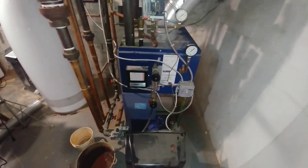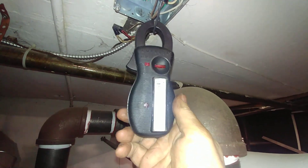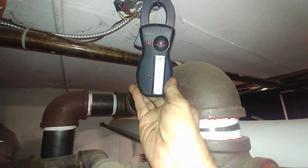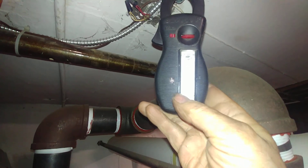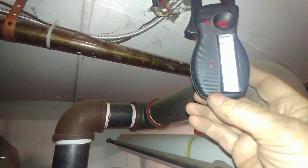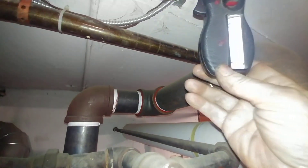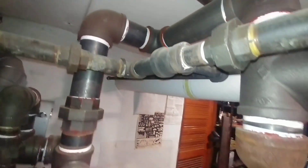This is our unit here — we're coming up on nine minutes now. I wanted to share with some of you who wanted to know the amp draw on one of these. That's on the six amp scale and I've got this looped around. So when this runs, it's drawing about 1.3 amps. Right now it's on standby and the number of amps being drawn is negligible — not measurable by that scale. Probably if I had a more sensitive scale, this might register.